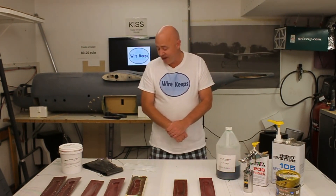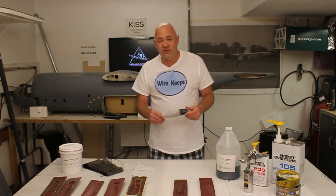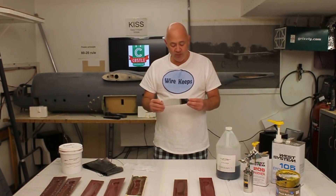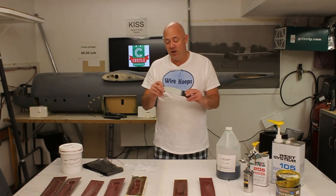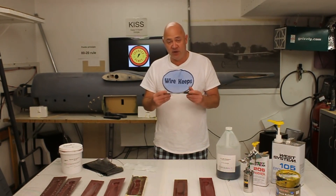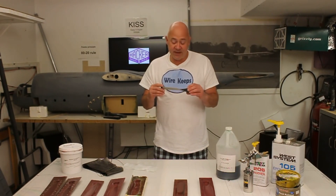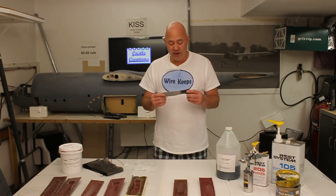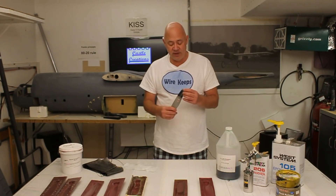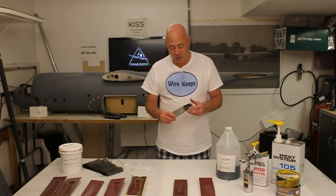The biggest reason I'm doing this is when I go to make the propellers for my C-130 project, I started with wooden props and the wooden props have to be machined perfectly or the prop tip does not track right when the propeller spins. That's been a huge problem. I've spun them up to 6,000 RPM and the hub and bolts have never failed, but the prop tip tracking has always been off and it looks bad.